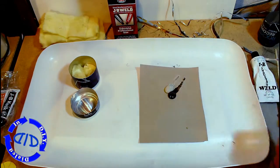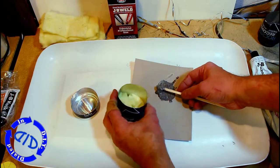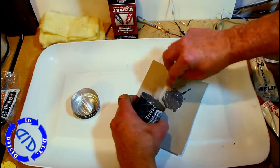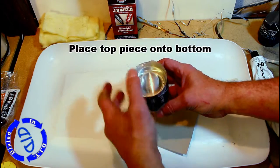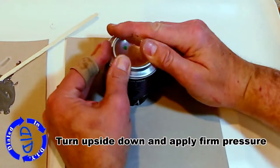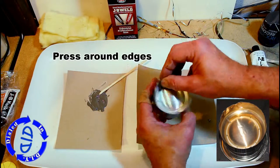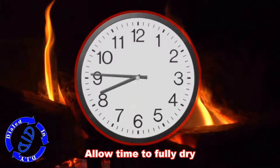As I mentioned before, I'm using the JB Weld. This stuff is perfect and you can find it in most hardware stores. You're going to use equal parts of each of the two tubes and mix it up very well first. Basically what you're going to do is smear a little layer of this around the inside of that bottom can right along the top, as you see I'm doing here. I'll rotate the can around so you can see what it looks like all the way around the inside. With this done we're now going to take our top piece and place it on top of our bottom piece — both facing in the same direction. Once we get it to this point we're going to turn it upside down and start to gently and firmly press all the way around. Once it gets started you can press a little bit harder, just be cautious to continually turn it to make sure you don't buckle it too much on the inside. Once the top edges of both cans line up, turn it right side up again and gently press all the way around the inside lip. This will make sure there's good contact between the two cans. Now you just need to allow time to dry.